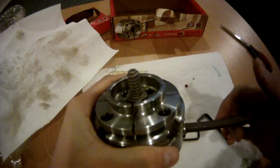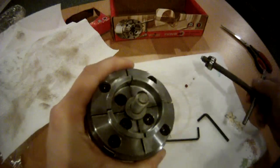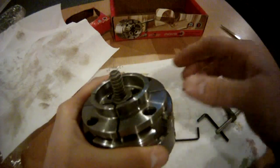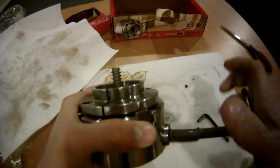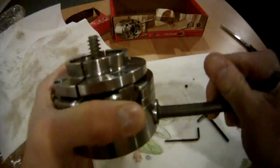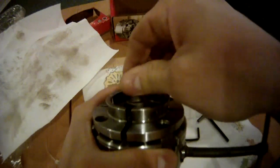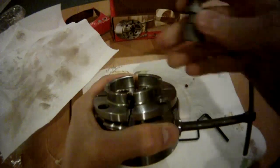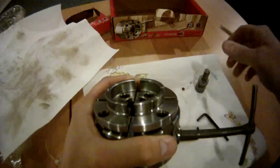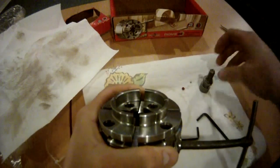So if this is threaded into a bowl blank, you can easily use this to be able to get started turning a bowl. And then when you're ready to move on, advance and remove the screw. Again, just simply open up your chuck jaws with the key, and then give that another turn. And then that'll just come right out, except for it won't go right through to come out with your workpiece on the other way. To be able to be ejected if you had any trouble, again, you could use a knockout rod to pop this out if you had to.